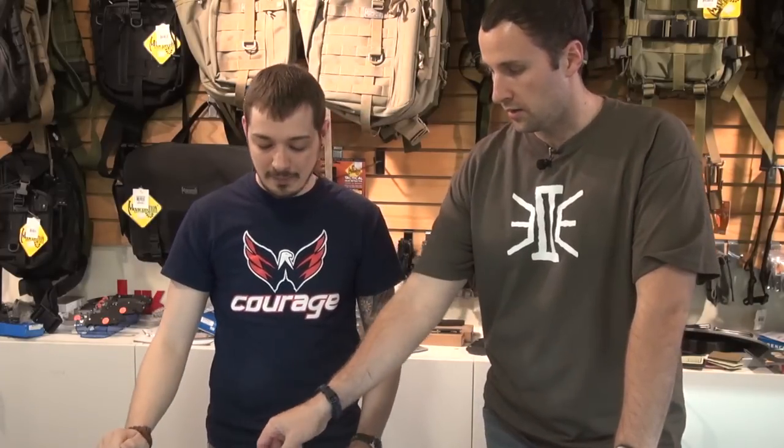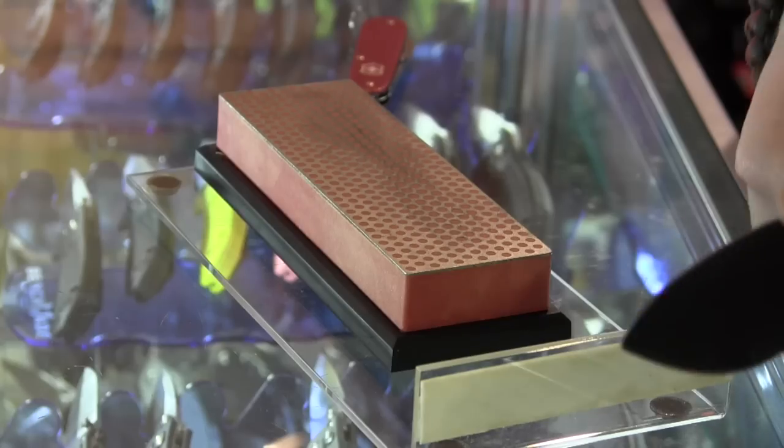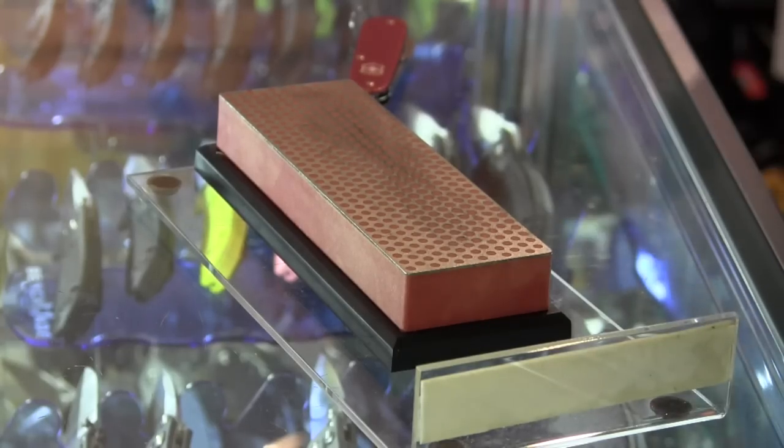And if you drop them, they'll probably shatter — they're pretty hard. One thing you really have to pay attention to, depending on the kit you get: if it has round or triangular stones, watch the point. If you're pushing down and go off the point, you're typically going to end up going off to the side, because you're applying pressure downward and then there's no support — it kicks over and you end up sharpening the point off. So you won't have a very fine point; you have to go slow and steady. And that's exactly what happens — it'll still be sharp, just not pointy.